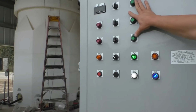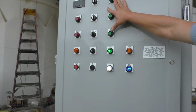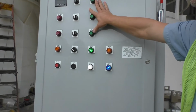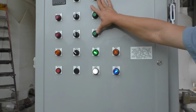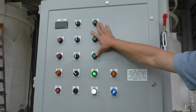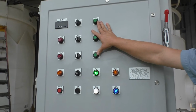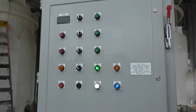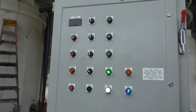Okay, well here's what's going to happen. Your pumps are going to be running, and you're going to lose power. And even though it's in hand or auto, the PLC, when it restarts, thinks you cut it off. So it's going to go into a flush mode, which is not a bad thing. But you say, oh, my pumps aren't, I'm not getting any lime anymore. That's because it's flushing. Because it thought you turned it off, not the power surge or whatever, or the switchover.